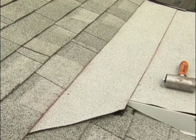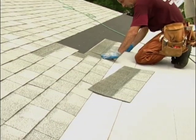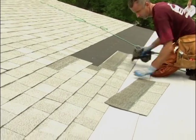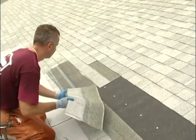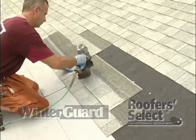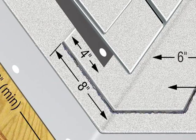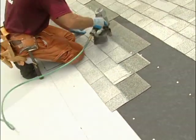The slope roof is now ready to receive shingles. The bottom edge of the first shingle course should be positioned approximately 1 inch above the low slope deck. Be sure to follow guidelines for appropriate underlayment such as CertainTeed Winter Guard or Roofer Select. Underlayment should cover 4 inches of the 8 inches of flashing strip on the slope portion of the roof.